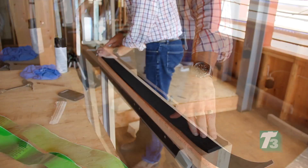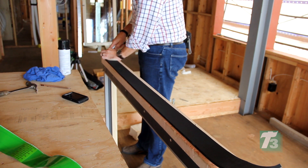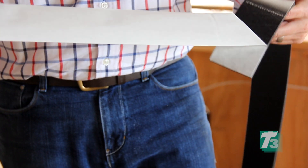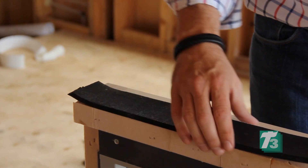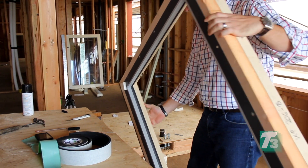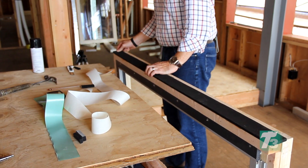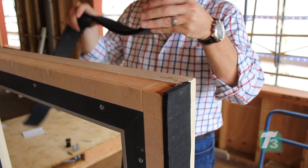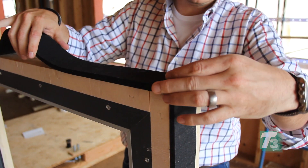The applicator can then install the Trio onto the window jambs and head, remembering to always add 5% to the length when measuring the Trio. For the jambs and head, the installer will stick the Trio to the window itself, as you can see him doing here. Again, make sure that the white edge is positioned to the interior of the building. Be sure to pay attention to the corners and make sure the Trio makes contact with itself in these areas.